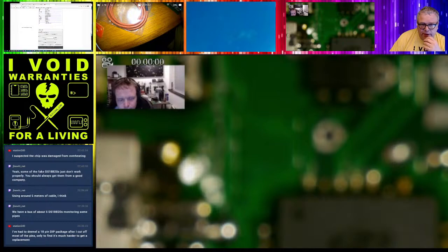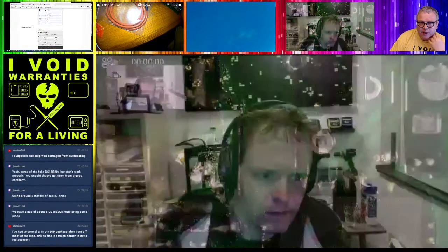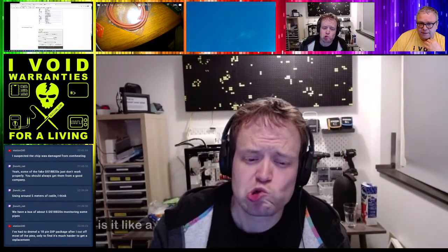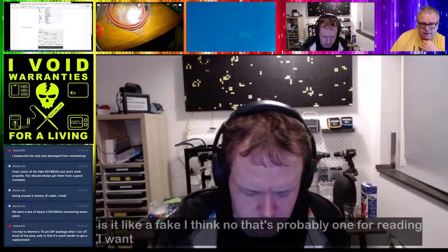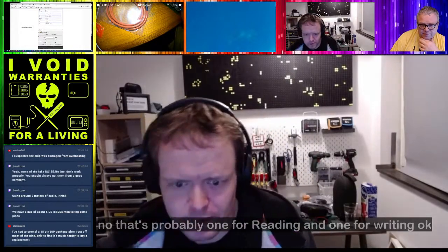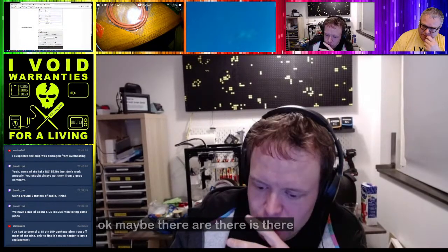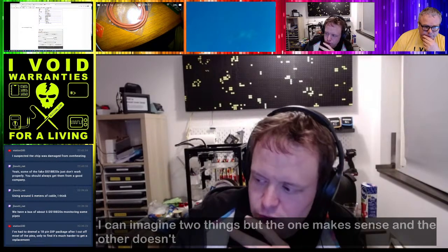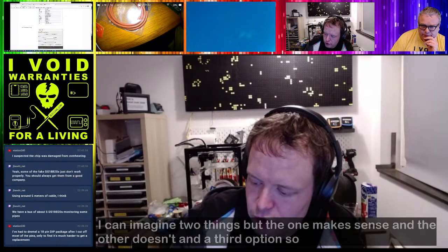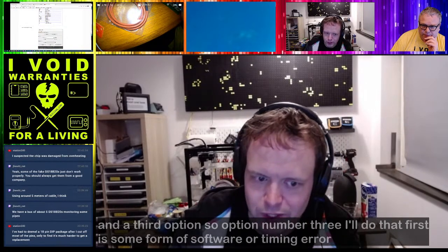A question for you, Sebas. Yeah? Sometimes I run into EEPROMs that have two I2C IDs. Is that like a fake thing? No, that's probably one for reading and one for writing. Oh, okay. I can imagine two things, but the one makes sense and the other doesn't. And a third option. Option number 3, I'll do that first, is some form of software or timing error which causes it to do weird stuff.